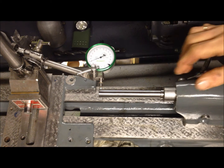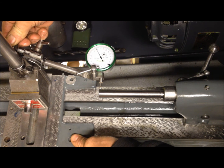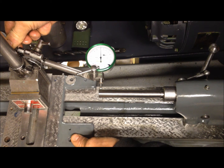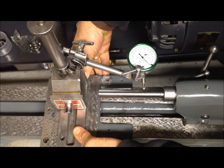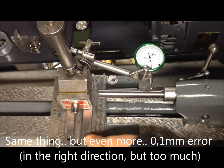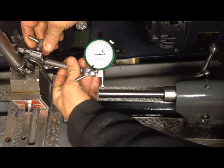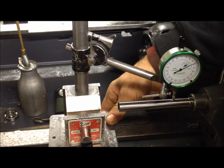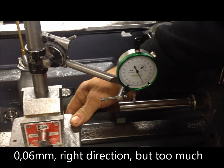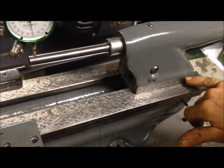Now the check with the test bar in the cone there, and then zeroing the indicator again, we run it towards the tailstock and we see that is a longer run, but we have almost one-tenth of a millimeter deviation — ten hundredths — that way, and I suppose the same this way. So that is too much. This means that I have to scrape, shim, and do the tailstock base.